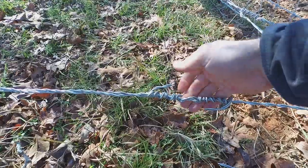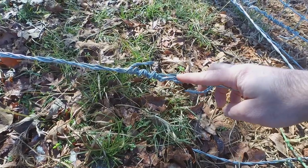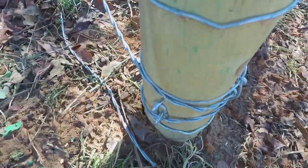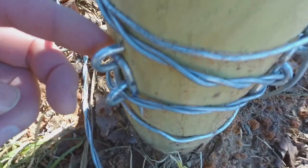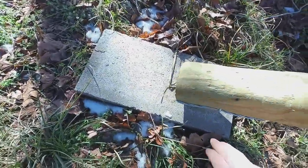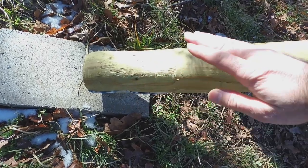It's very similar to how you do a regular barbed wire fence. Just wrap, put these together with six to eight inches of overlap on each side. Then come to the middle, grab your pair of pliers and hold it right here so you can get some nice tight wraps. Wrap this one over the top this way, and when you come to this side, wrap it over the top the opposite direction. These are actually wrapped opposite directions, and that helps these wraps hold really good. There's a loop I made to run the tension wire through first, then I come up above that, put another staple, and slide a loose staple in behind so that the wire can rest on that staple and not cut into the wood. With floating braces, you need something good and solid to set your brace post on the ground — you don't want the post just sitting right on the ground, as that's going to loosen it up over time. As you tension the fence, it's going to dig into the ground and make it really hard to get and hold the necessary tension.